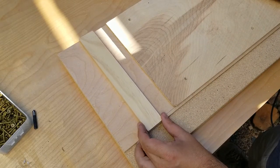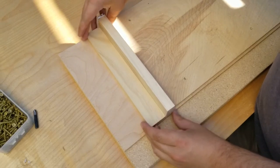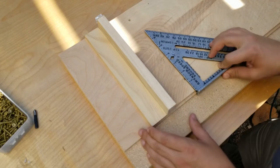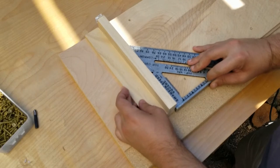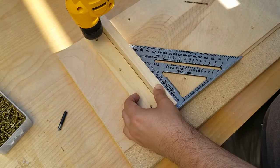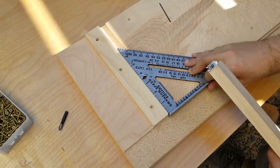For the stop at the top, I added a small block that could be used as a stop for really thin pieces of material. I needed to make sure it spaced out some from the top for some future attachments, and then I used a speed square to make sure it was perpendicular to the planing surface. It's important that the speed square is used against the actual runner that the plane will be moving along to make sure you get that perfect 90-degree angle.